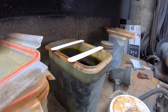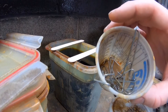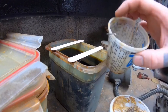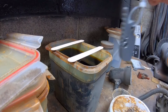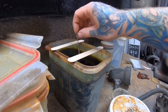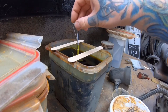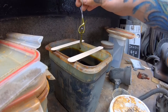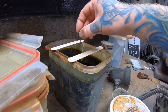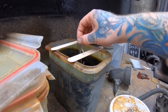I use a couple of titanium rods — similar to what I use to anodize with — and the ferric does nothing to it, so you can soak it down in there. I'll hang a blade off the rod, give it a dunk, and agitate it a little bit just in case there are any bubbles in little nooks and crannies — like in the jimping on the back. If you don't do that, you'll pull it out and there'll be spots that didn't get hit. Then I prop it up on the tongue depressor.